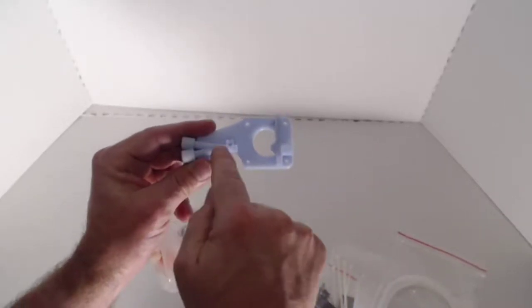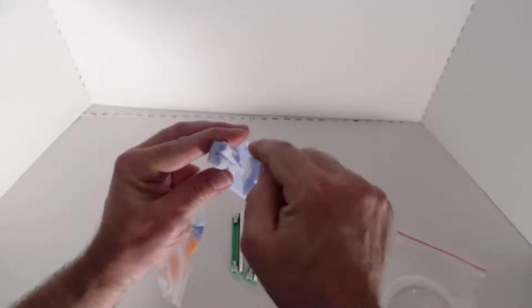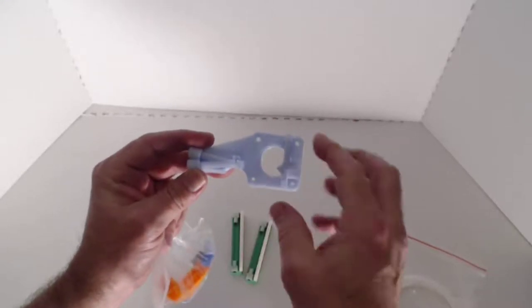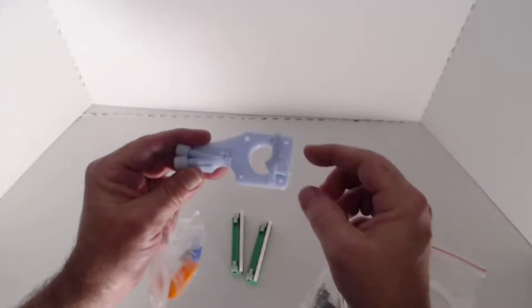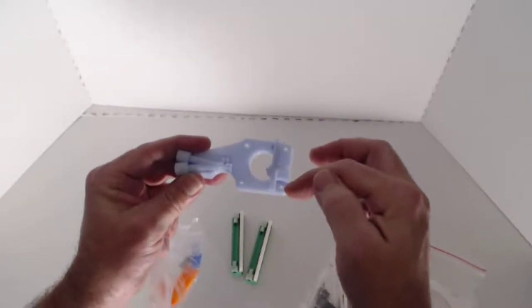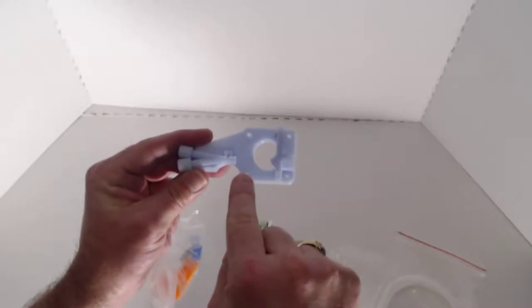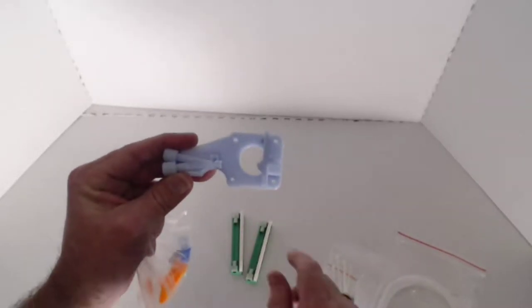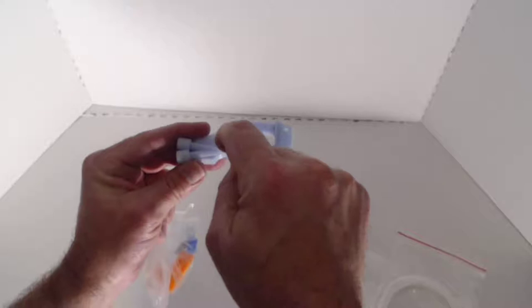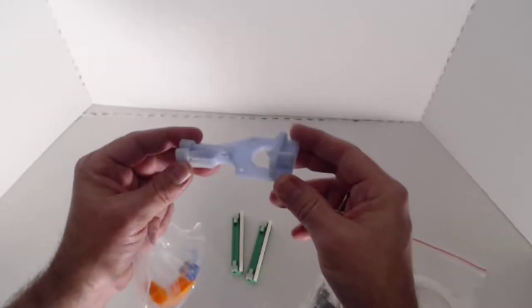It has the Y-splitter. So this is for the Creality 2 color. If you were using the Creality 5 color, there would be 5 inputs right here. And this is just going to bolt up using 5 mounting points here. The 3 here, here, and here are actually from the original extruder. In fact, the arm is going to be there. We're going to replace this screw with one of them from the hardware kit. This is going to screw down into the brass nut for the Z-rod.